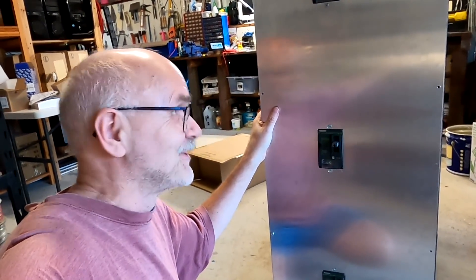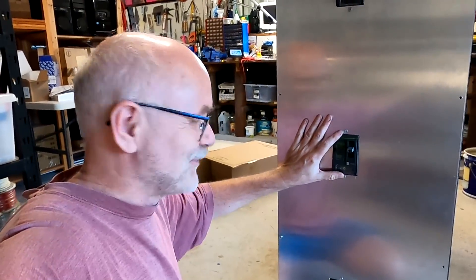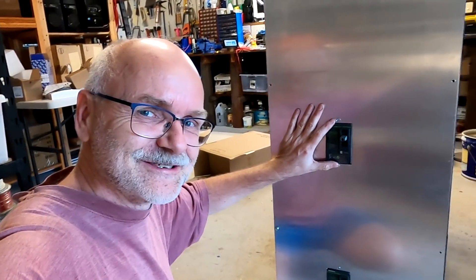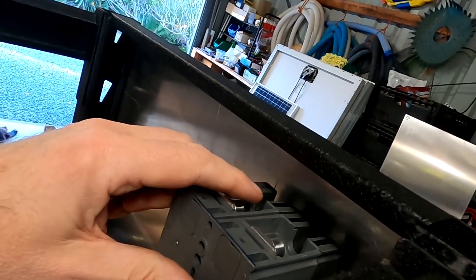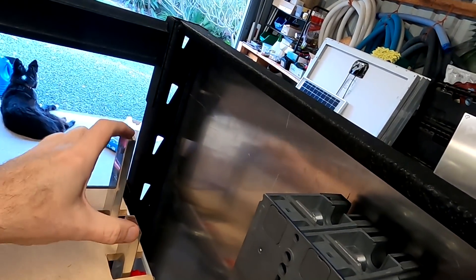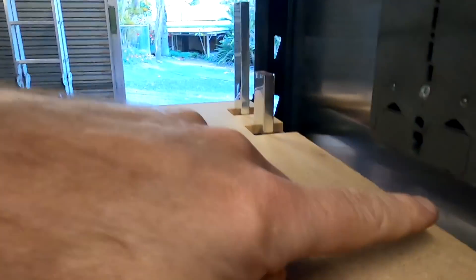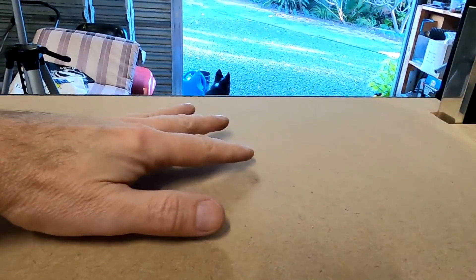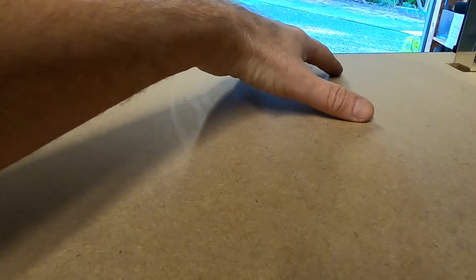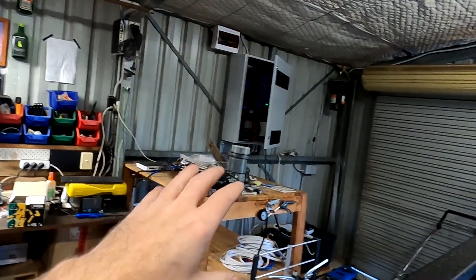That looks very industrial. I don't know why they make them so big, these 100 amp breakers — they are so huge. And this is just enough space to connect the cables here, because we need to come from the bus bar here to this side of the breaker. And on the output of the circuit breaker it goes to two bus bars mounted up here somewhere, and from there we go to the smaller circuit breakers at the front, then to our inverters, solar charge controllers, and other loads. That's the plan.